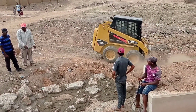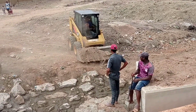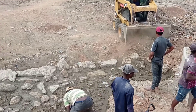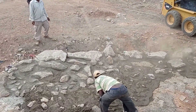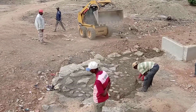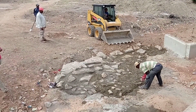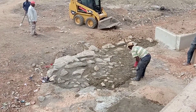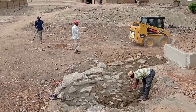As you can see, the mason is putting the mortar and doing the interlocking of the stones or boulders. This is the inlet of the box culvert. We always have to provide the stone pitching for the downstream. As you can see, the topography is in a way that our inlet is in the downstream.